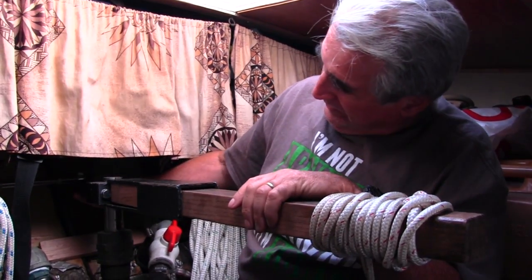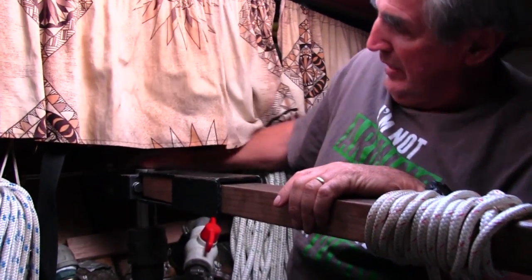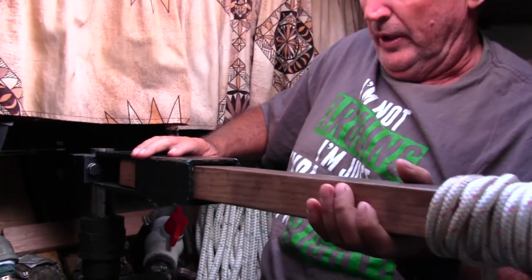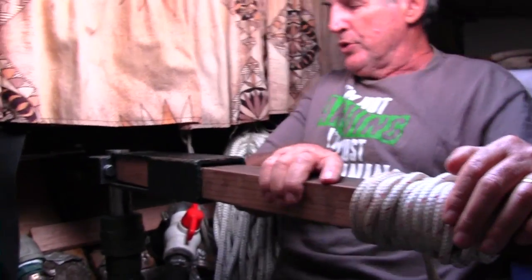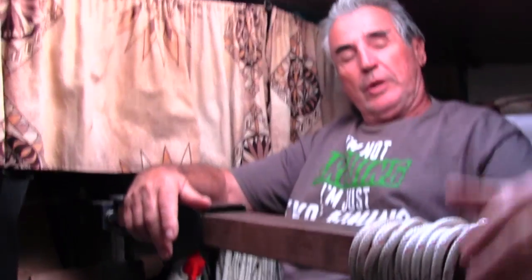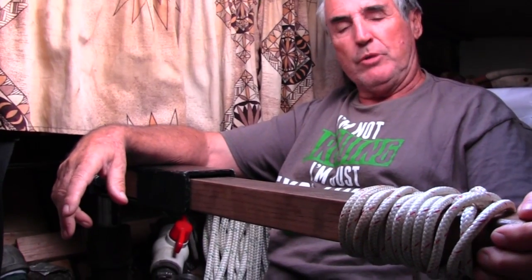From the back, it's a hydraulic ram which controls our steering, and in the front part of it we install a fitting where you install a removable hunk of oak for an emergency tiller. Now the hatch is right above it, so in nice weather you can open the hatch and stand up in it to watch as you're steering. In bad weather you can be down here and steer by the GPS.